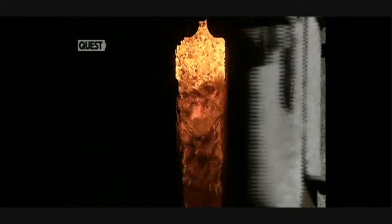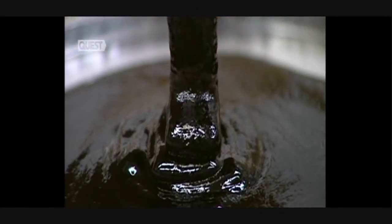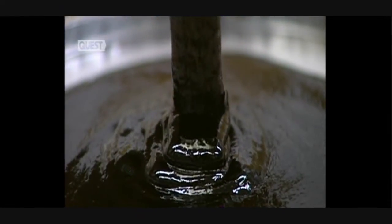This is the recuperation boiler, which burns wood at 1,000 degrees. Certain chemical products which come out fused as lava are recuperated. This black liquor, a residue of burned wood, will be burned to produce steam.